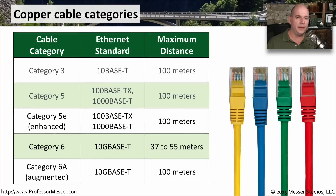These standards are important because when you connect wiring into your infrastructure, you need to be assured it can transmit what you need across the link. If you're planning gigabit connections, you need wiring that supports a gigabit link; for 10 gig, you'll need different wiring. These standards let you buy cable based on a standard category. The relevant categories for the Network+ certification are Category 3, 5, 5E, 6, and 6A.